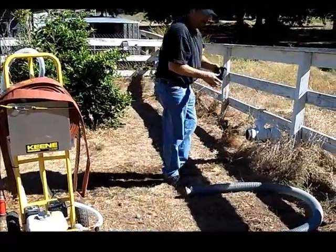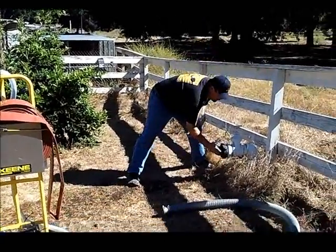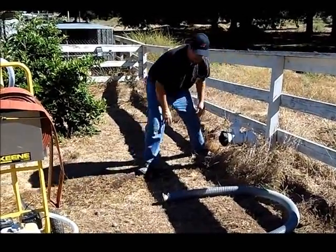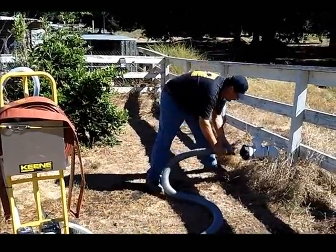Next you're going to want to take your hydrant adapter. In the county, this is code — it's a 4-inch national hose adapter. Tighten that on; hand tight should work. If it leaks, you can always tighten it up. Tap it with a little brass hammer.